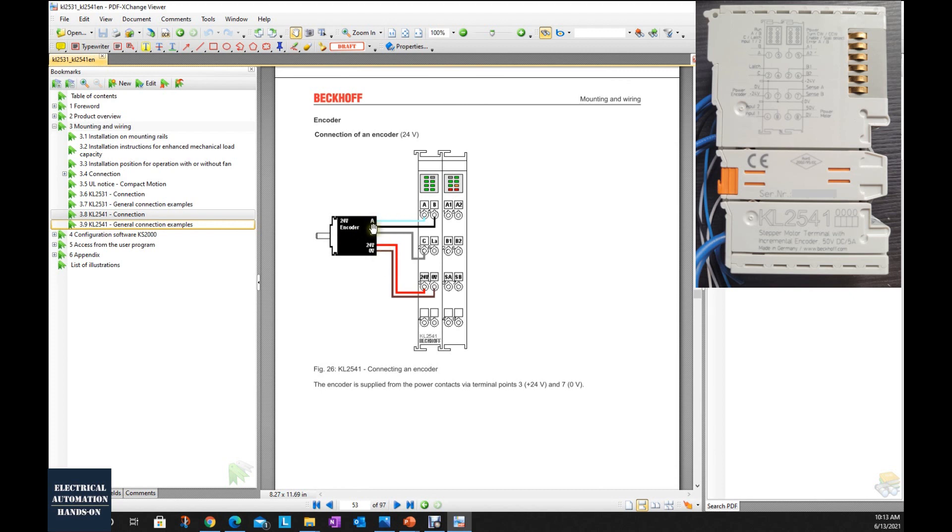For the encoder, scrolling down we can see the encoder has five pins: ABZ or ABC signals connect to ABC here. The encoder also needs a power supply. If the power backplane can supply 24V, the encoder wires can get power from those two terminals. However, if the left side blocks the power supply, we can individually supply power to the encoder — but keep in mind the zero voltage potential must be aligned: our power supply zero and the encoder power supply zero must be connected together.